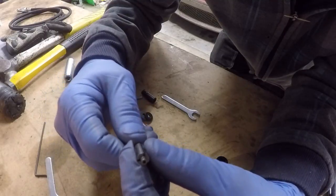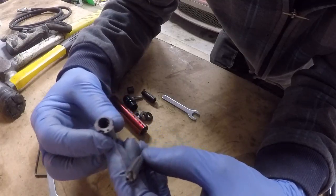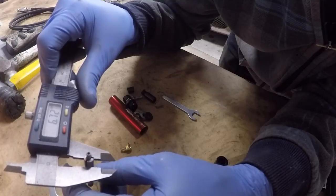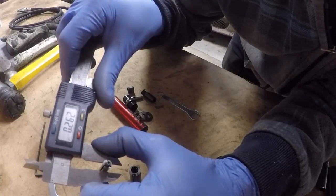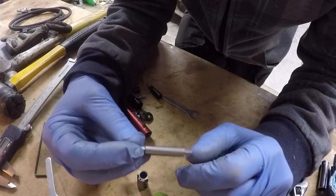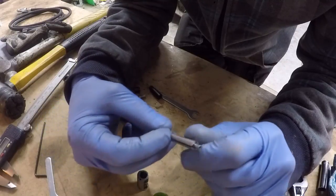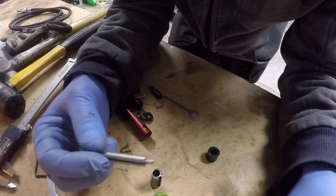One thing that you will notice if you compare this rotor or this motor to the motors in my other videos is that this rotor or main motor shaft is extremely small. 6.72 millimeters, and in inches it is 262 thousandths. We want this to be really small, and so we're giving up some efficiency and some torque in order to achieve that small size.